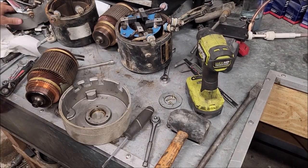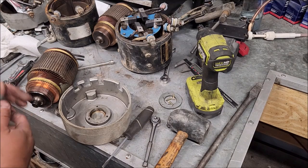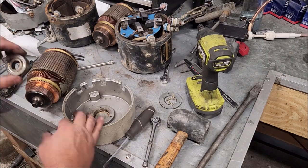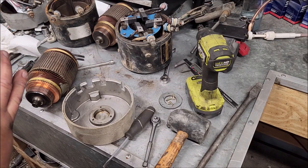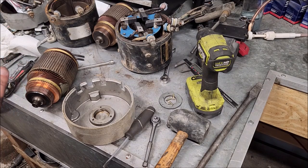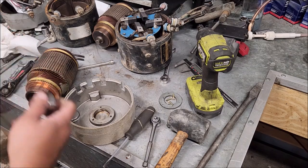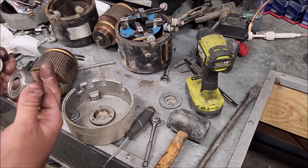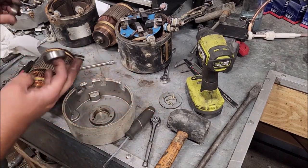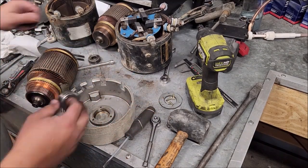Okay, I'll just go ahead and put a new bearing in this one. It's marked 6203 ZZ. That old one had a 6203 Z, which is a single seal. The ZZ is a double seal, which is what I have here. So it looks like the bearing has already been changed at one point in its life.